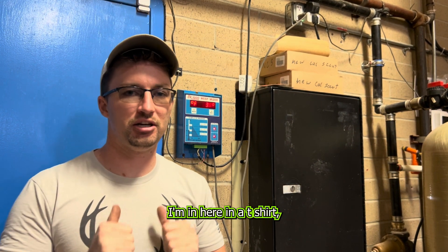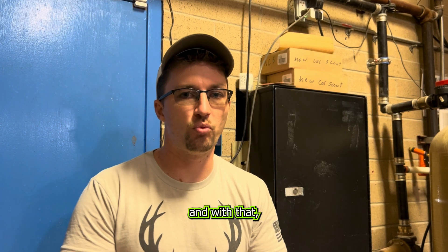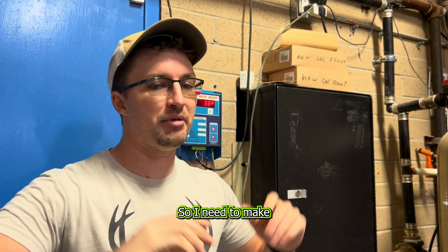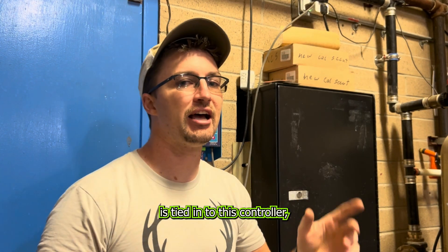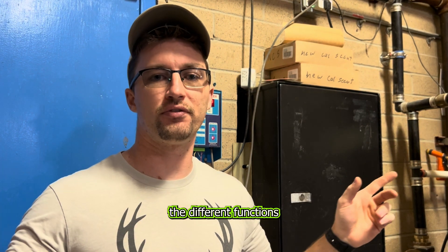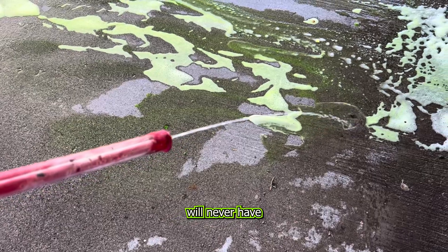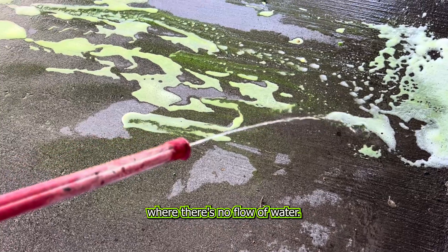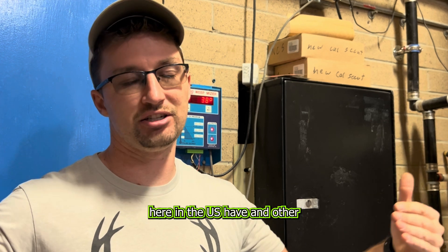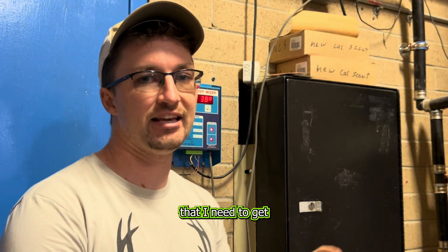I know I'm in here in a t-shirt, but the temperature on the wall will tell a different story. We're starting to get into winter and the temperatures outside at night are getting well below freezing. I need to make sure everything inside this car wash is tied into this controller, called a weep miser. It weeps water out of all the different functions in the different bays, so all the hoses and pipes that run this car wash will never have an extended period with no water flow, so it can't freeze over. That's what car washes in northern states here in the US have in climates where it gets below freezing.